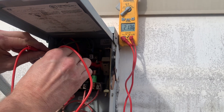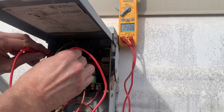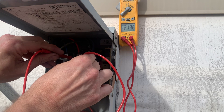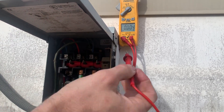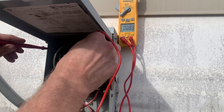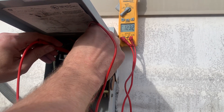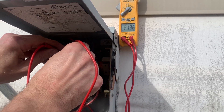If I go to my line one to line two, look at my voltmeter — line one to line two: 213, two to three: 213, one to three: 213. So all three legs are giving me good power. If you tested them to ground, you'd get 120 on one, 120 on two, 120 on three — which is why when you combine any two, you get 213.